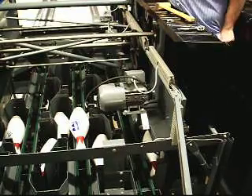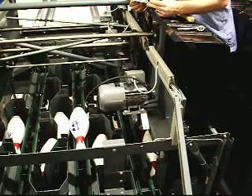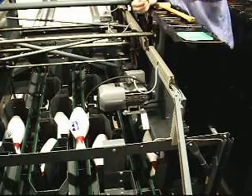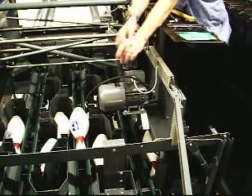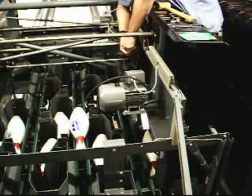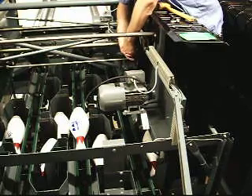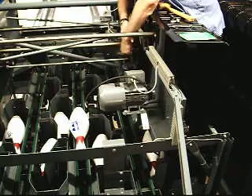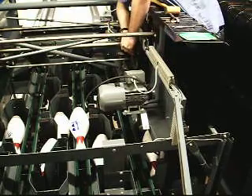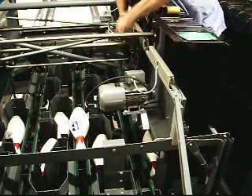I'm taking one of the Brunswick 10mm bolts. You can get whatever size fits properly — this one is about 40 millimeters. It has a 10mm head and I've got a 10mm lock nut. I'm going to drop it straight down through the shaft and rotate it around to this side. The 40 millimeters seems perfect because it can latch down with just enough space to hold the pin, without a lot of extra threads sticking out. Put the lock nut on this side and tighten it down.